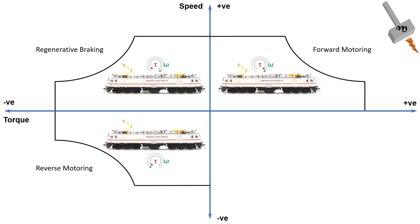This is when the motor is operating in the third quadrant. During this condition, the three-phase inverter of the propulsion system will have one of the phases energized later than the other two phases, thus changing the sequence of the three-phase supply and achieving reverse torque. This is reverse motoring mode.